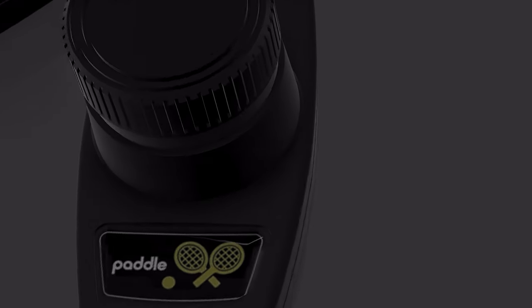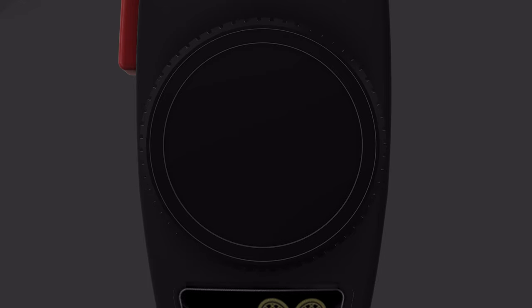The paddle controllers are analog mechanical devices, and many factors could introduce inconsistencies in how long the capacitor takes to charge. The manufacturing of the capacitor, the age, the temperature, all these can affect its performance. The same goes for the potentiometer: the manufacturing, age, wear and tear, and even dirt or other foreign material that finds its way into the protective case. In addition to the analog inconsistencies, most of the movement on the dial is unmeasurable.